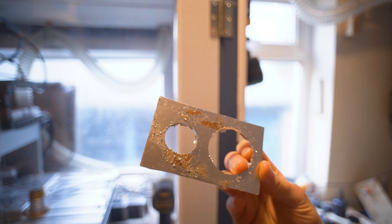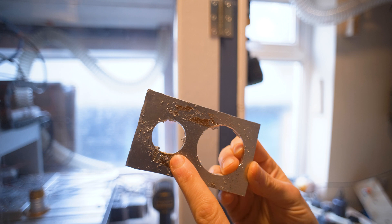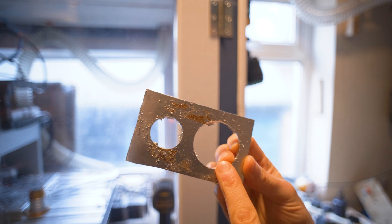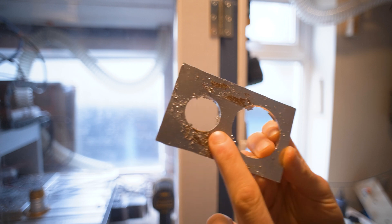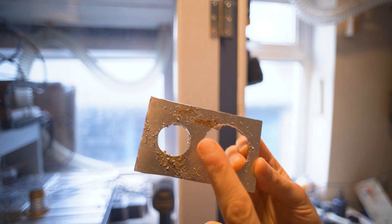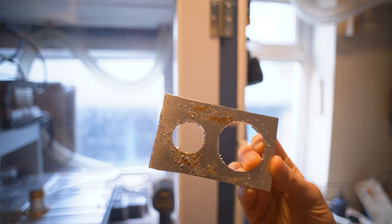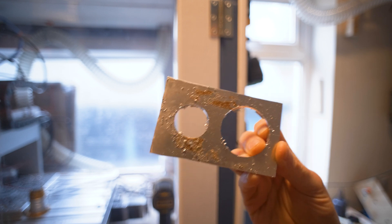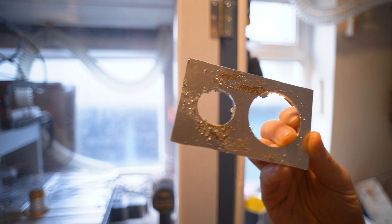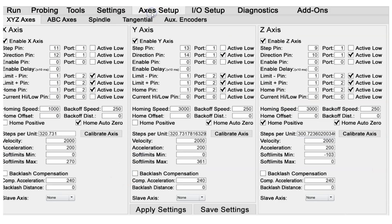Once I had that set up I could start to machine my first part. The first one I machined actually turned out smaller than I was expecting — this is meant to be a 40mm disc and it came out smaller. The reason is that I didn't actually calibrate the axes in UC CNC. This is actually quite an easy thing to do because I was kind of dreading having to set all these motors up again and get them all calibrated within a new bit of software. Let me show you how you do it in UC CNC because it is very, very easy.